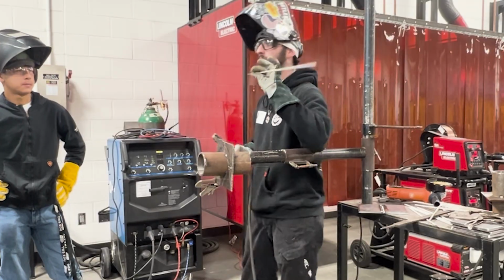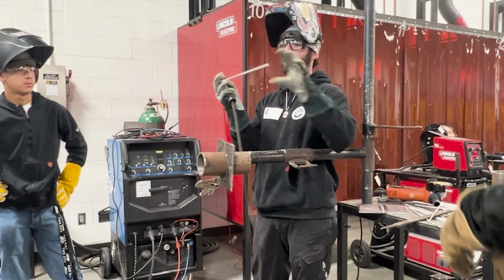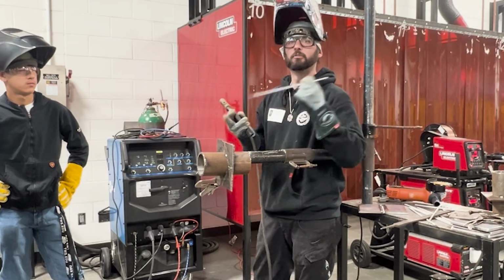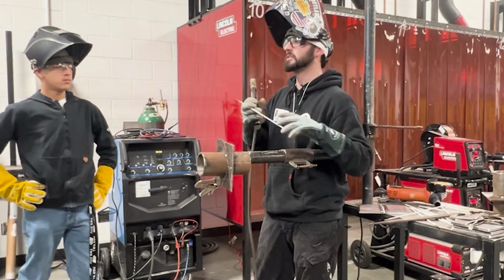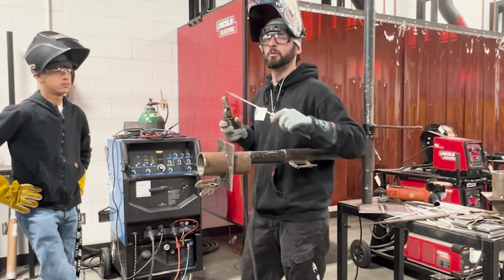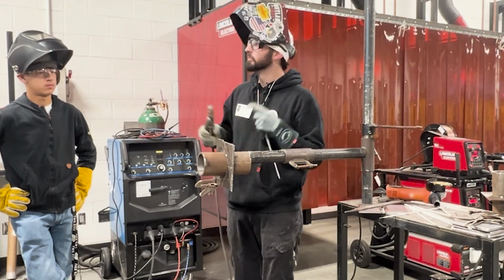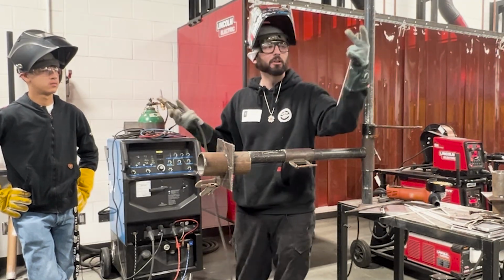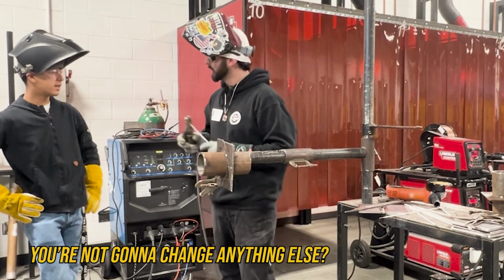And again, these aren't big boy rods. These are 5/32 and 1/4 inch, the big boy rods. They even make them longer, like this long, because of deposition, production, these sort of things. Like welding on tanks and stuff, they're welding these big old jet rods about that long, 1/4 inch around, because things got to get done. And taking a rod on and off is not how you get it done. But it's windy, it's blowy, can't use MIG, flux core, whatever. Longer rods, bigger rods.